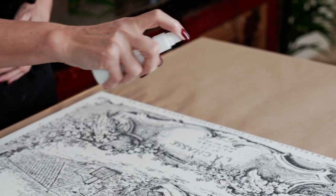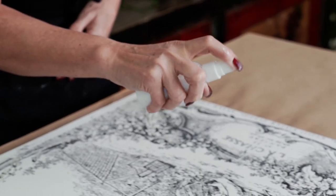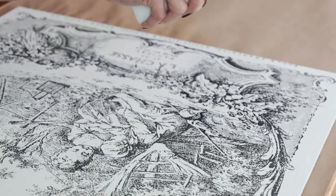We have all of them removed and our beautiful design is ready. We're going to allow it to dry thoroughly and then come in with a two-step sealing process. The reason it's a two-step process is because the paint is reactive — if you went right in with a brushed-on water-based finish, that's going to blur it. So first we want to set it with a sprayed-on sealer: your favorite water-based polyurethane in a spray can, or a water-based polyurethane diluted one-to-one with water in a spritzer, shaken well and then spritzed on.